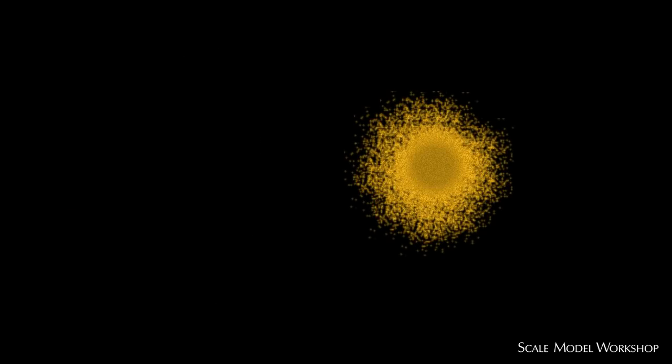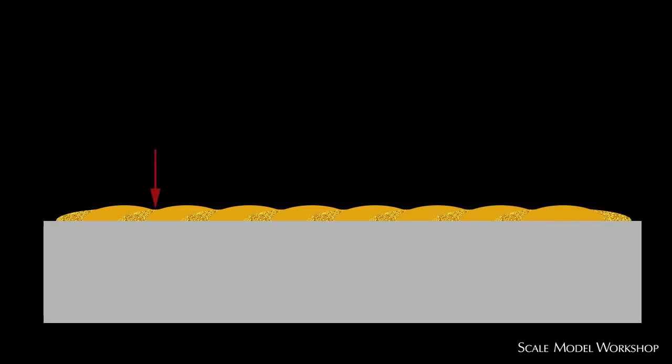A small round airbrush pattern will in turn require many passes with little room for overlap, presenting real difficulty in maintaining a wet surface, resulting in uneven material thickness, as well as an inconsistent surface, broken up by areas of excessive overspray.